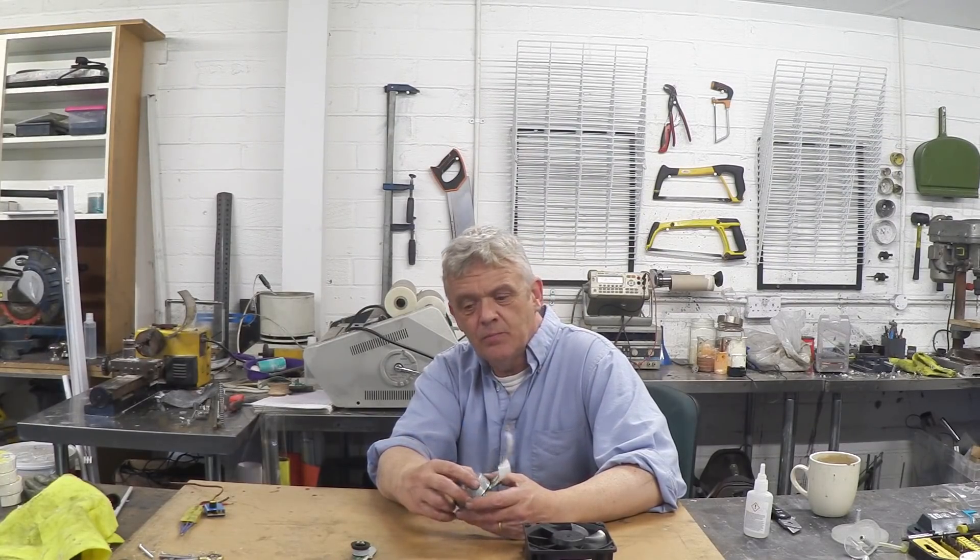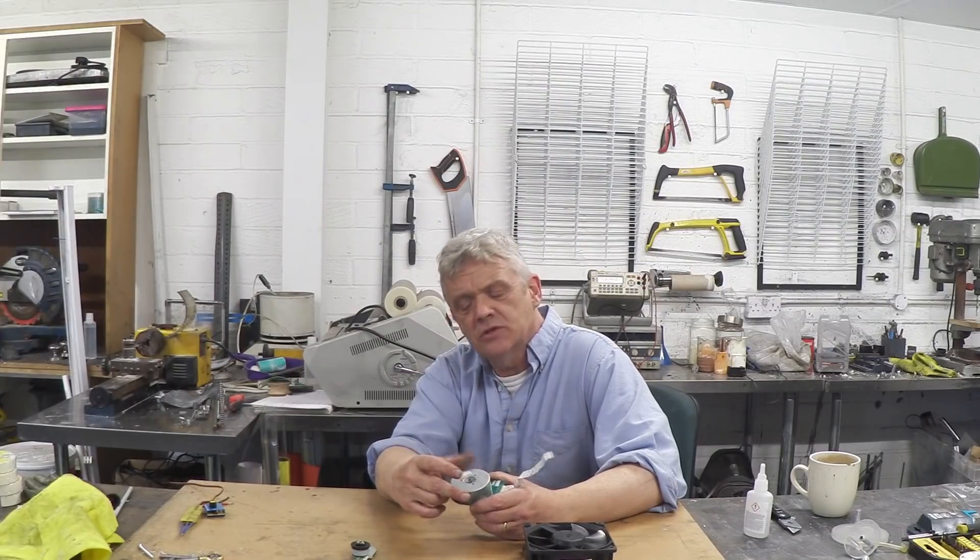When it's arranged as a coil and a magnet, it's either going to be a generator or a motor, depending on how you use it, and you can use it either way. That's really, really useful. The thing about brushless motors is they're incredibly robust and cheap to make. There's very little to wear out apart from the bearings, and they just go on and on, and their output is actually quite respectable. This one is from a printer — about the size you'd find in a generator.